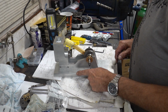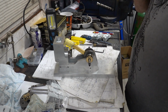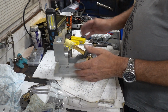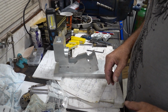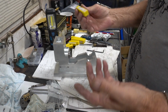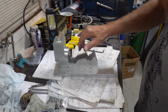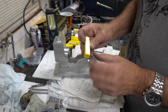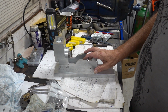And then I've got to decide, like I said before, whether I've got to cut some of this away for the flywheel so it don't catch my fingers when I start it, if it ever starts, that is. But everything lines up, so I'm very pleased. And once I got that counterbore, it's just a doddle with a counterbore. Although I had to drill the holes out slightly bigger because I'd done them 5mm, and the 5mm counterbore needs a 5.2 hole. So I had to open them out. I think I ended up using an Imperial.